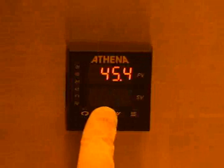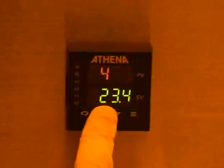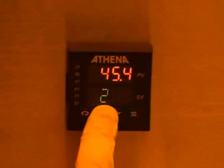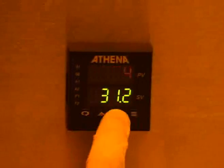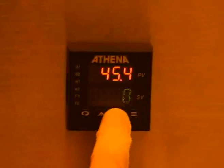To use the hot plate attached to many CEE spinners, a temperature controller positioned below the hot plate is used. The current hot plate temperature is displayed in red, while the set point temperature is displayed below it in green. To change the set point temperature, you simply have to use the up and down arrow keys.